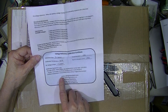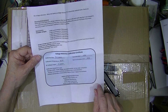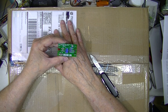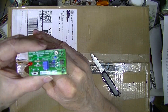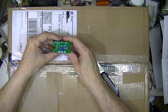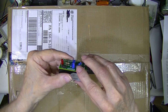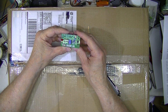Temperature was measured with a 5-digit digital thermometer made by Oakton. With the exception of a signature, this is the way a calibration certificate should look. So if I'm going to evaluate something like this, or any number of Chinese pre-built references, it doesn't make sense to use a 2-digit voltmeter to say yay or nay about it. And if I'm going to assemble some standards — there are two kinds generally: three-terminal non-adjustable standards, and voltage references that can be standardized using an adjustment — how am I going to do that with a two-and-a-half or three-digit voltmeter?